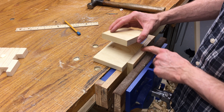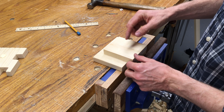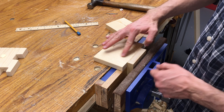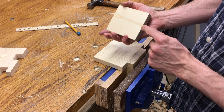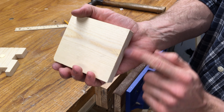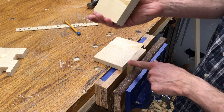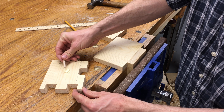Now I'm going to rest this piece right on top. That way it's nicely secured in the vise — I'll be able to glue it, drill my pilot holes, and nail it in there, which should keep it fairly stable. Make sure you know which end you're using; I've marked arrows on mine. As with any joint you're ever going to make, you want the ends squared — I just ran these across my shooting board a little bit ago.